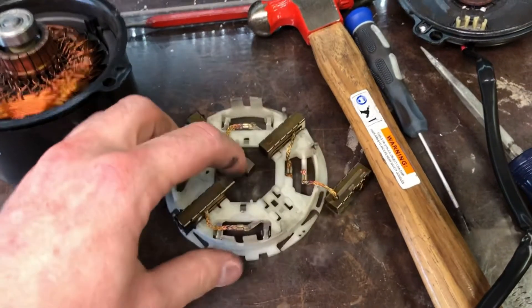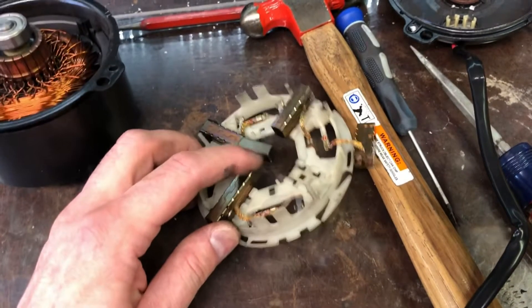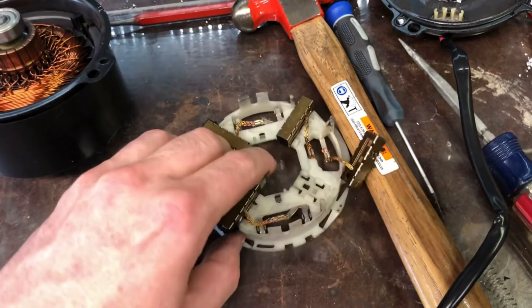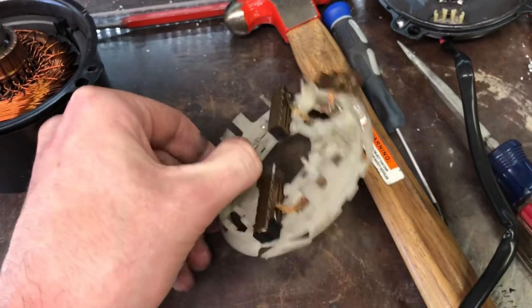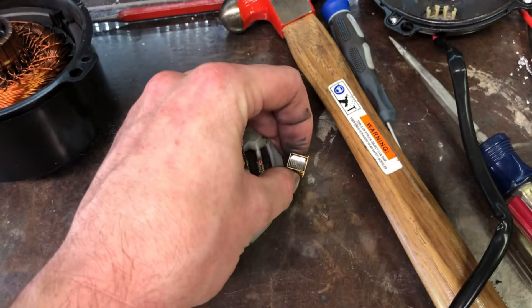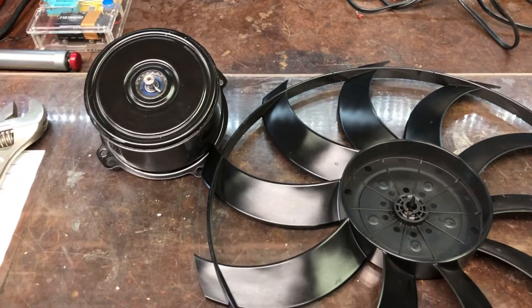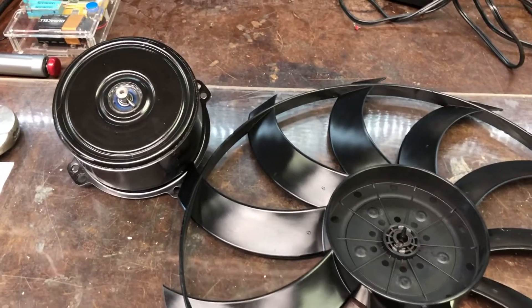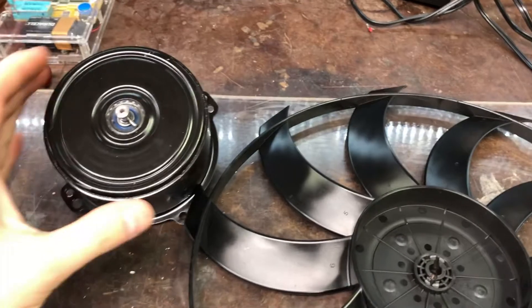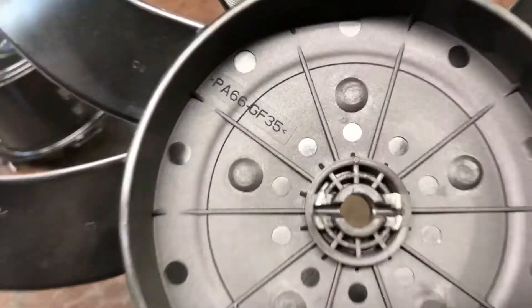This is pretty typical DC motor failure we're looking at here - there's a commutator brush issue. It could very well be that this brush got cocked in there from oscillation inside from the PWM, which would then cause a bad connection to the commutator and cause arcing and a catastrophic failure. It's not as bad inside as I thought it would be, but there are definitely issues - there are broken chips off the brushes and they're grooved. I was taking one last look at this thing before I tossed it and I noticed something as I was throwing it away. I looked at the back side of the fan and noticed it was chewed up in there.